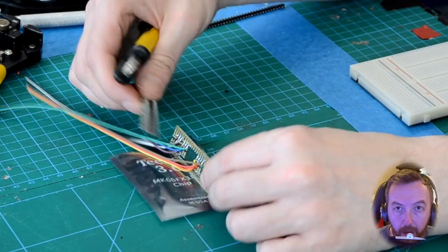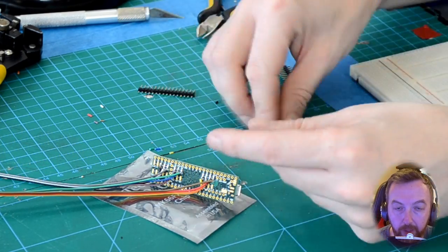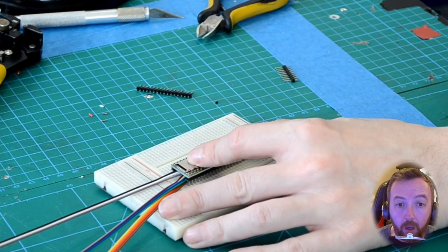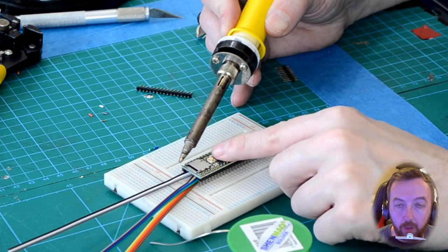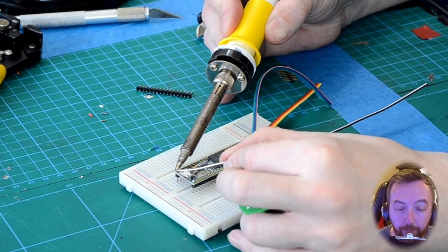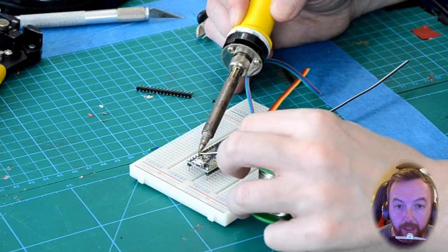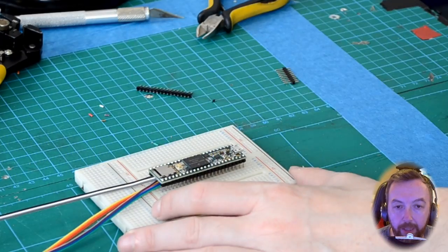Most Teensys have the option of buying them with header pins. I bought a set of male and female because we're going to use the female ones to fix it to the board. We just cut them down to the correct number — I think it's 24 pins — and hold them in place using a breadboard while we solder it, instead of trying to hold it while it's flopping around. If we solder just the corners first, it's easier to straighten things up afterwards rather than soldering the whole lot. There we go — the four corners done. Now we just solder all the pins; again, not too much solder — we don't want any shorts between the pins. That's all soldered.